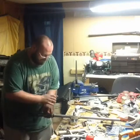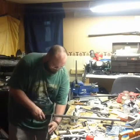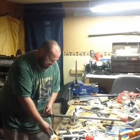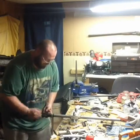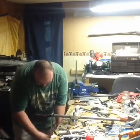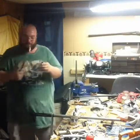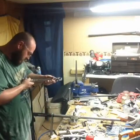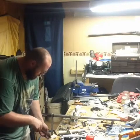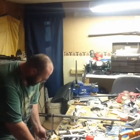So you just back your barrel nut back down against it. Once it's down against it, just going to give it a little snug right there. Now, once I have it snugged up, in whatever position the wrench is at, I make sure my wrench is set to 45 foot-pounds, or 35 foot-pounds. Which it is. And I'm just going to lock it down until I feel a click.